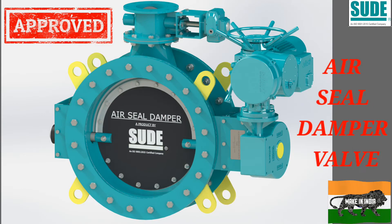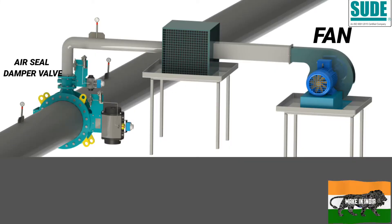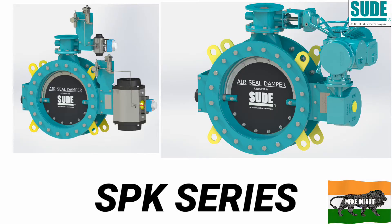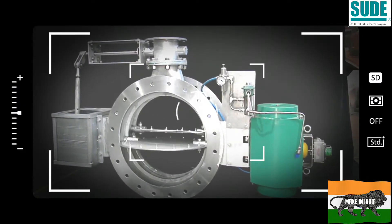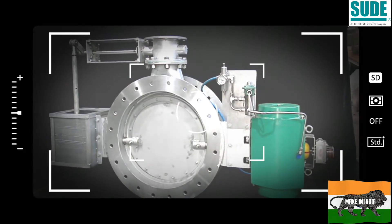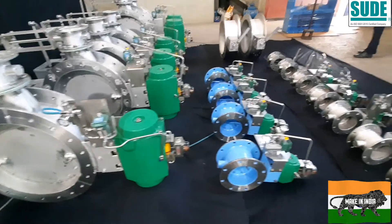Now let us talk about the core topic of today's discussion — air seal damper valves. Air seal damper valves are designed to isolate the air and gas flow in the gas duct. The system works by a fan blower creating a pressure between the gap of two blades, so that no aggressive gas can pass through the damper, since the air sealing pressure is higher than the gas pressure. These are available under the DRS series and SPK series, which is the core of our 1900 ASD series. Air seal damper valves offer a sealing efficiency of 99.9% using specially designed metal seals, with a leakage rate of 0.1%, which is isolated by the seal air barrier.